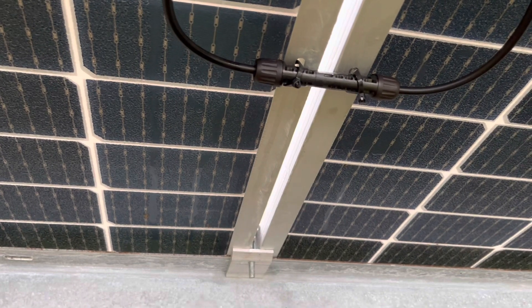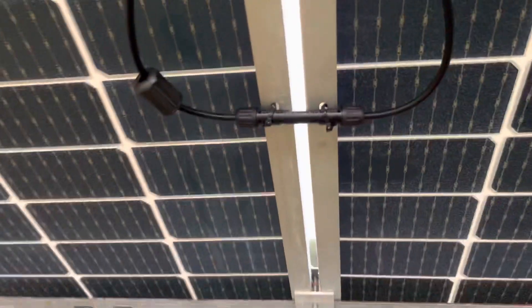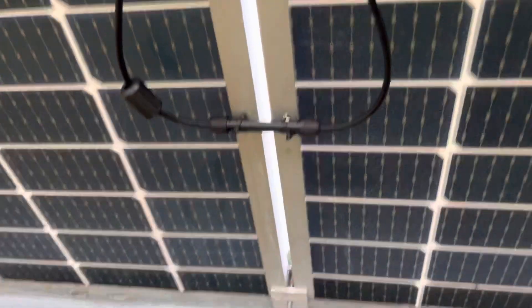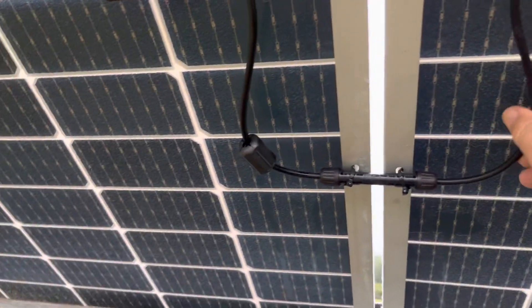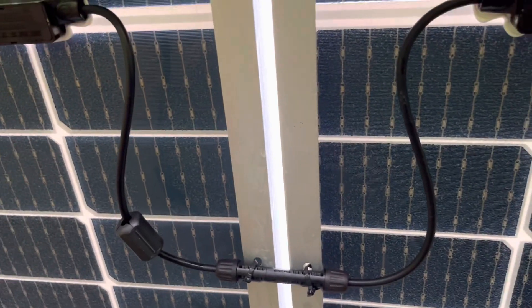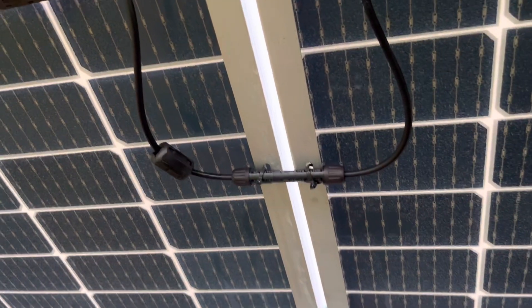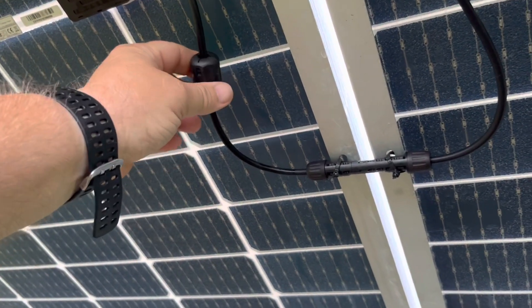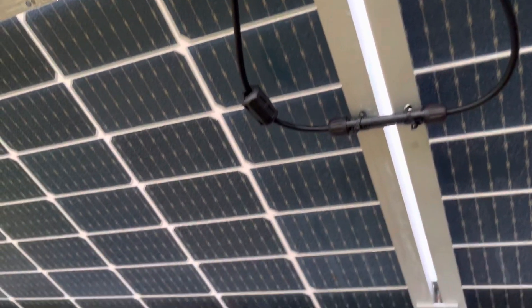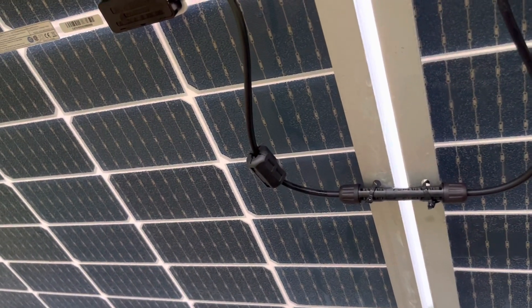Then the ferrite. That's the way I'm going to do each interconnect between the panels, and it's working out pretty good. There's no real tension on this cable, probably bent a little more than I'd like but it's the only way to get it together. I'll be putting a ferrite on the positive cable of each panel. What the ferrite is supposed to do is on rapid, high-frequency current changes, it's supposed to resist by creating a magnetic field to dampen the rise in an impulse.